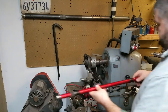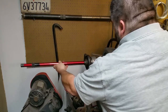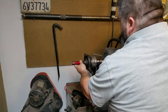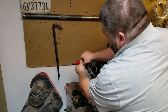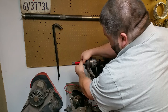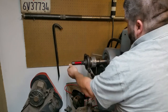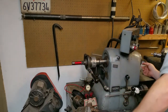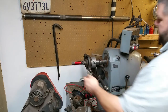The way this works, you loosen these up a little bit, slide it down into the end of your draw bar, then adjust until it squishes the O-rings so it fits in the draw tube snugly. On the back side it should fit down inside your collet.